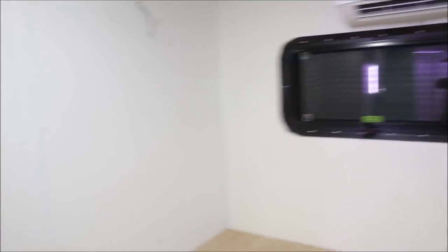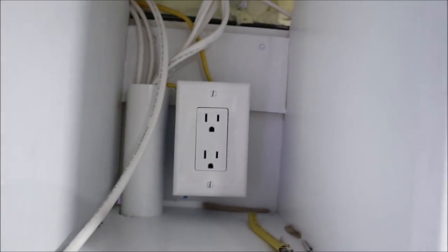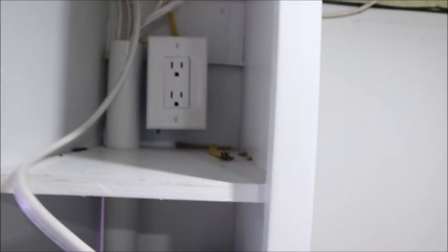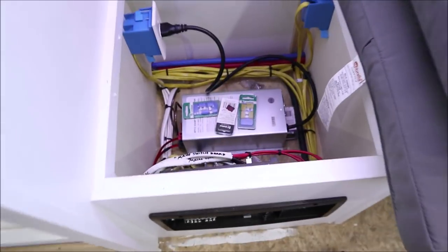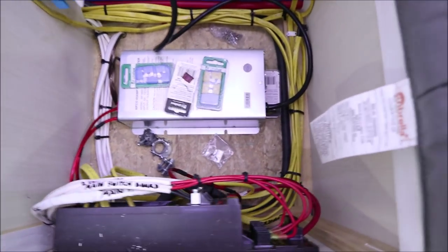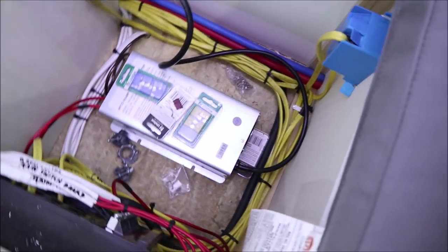The back window, we did get that installed. Some more electrical — I'm going to use that plug there for the TV that's going to hang on this side of the bed, so I can run my line up back here and have it hidden. All the lines run through this PVC pipe in the back of this cabinet, then underneath the bed and into the electrical compartment. It's still not done, but really close. I've got everything labeled — white lines are the DC, and yellow is the Romex 12-2 for the AC.